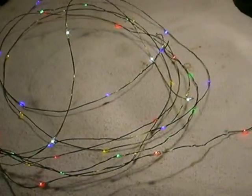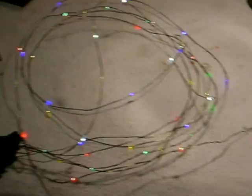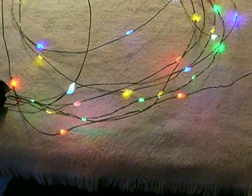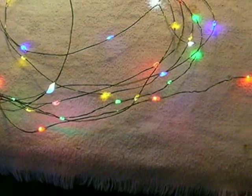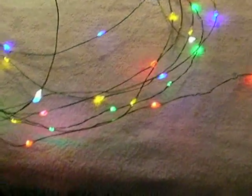This whole set of 45 lights is running off one 9-volt transistor radio battery, and the total current draw is only 40 milliamps — that's negligible. It'll run for many hours non-stop on one battery. You can also run these down as low as 4.5 volts; at that voltage it only takes 15 milliamps. At 6 volts it takes about 25 to 30 milliamps.